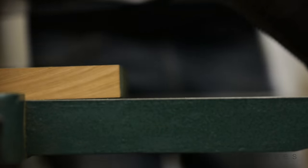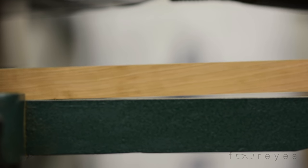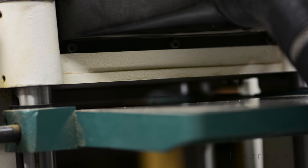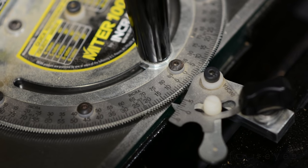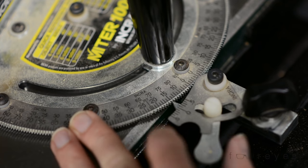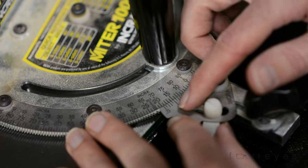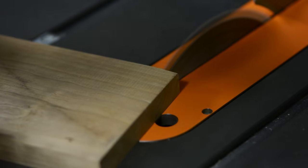After I joined and planed all of the cherry to the proper thickness, I built the four legs. I can get all four legs from two small chunks of wood by flipping things around and nesting them together. The legs are going to angle in 15 degrees from 90 degrees, so that's 75 degrees from being vertical. I started by making a 15 degree cut from the top and bottom of the piece that the legs would come from.